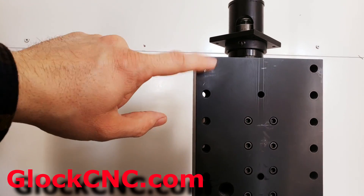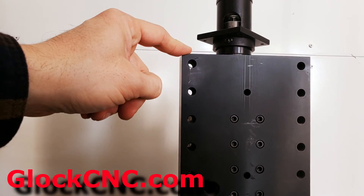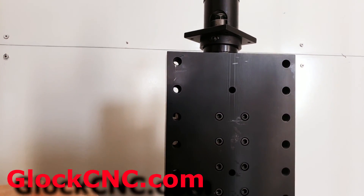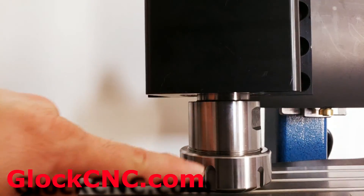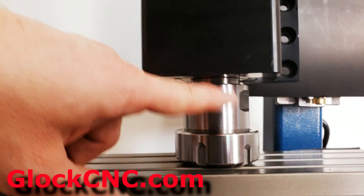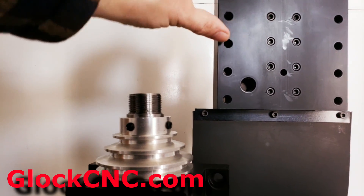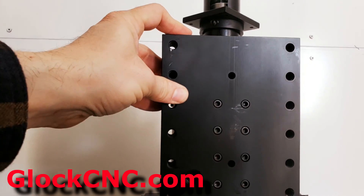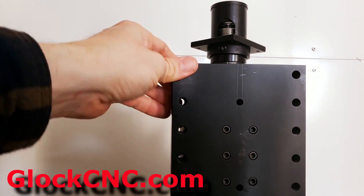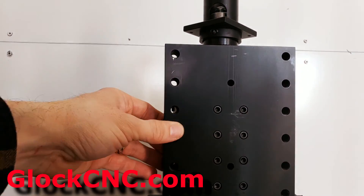The reason we did two different positions is that for people who like to use our R8, it sticks a little further below. The ER40 does too, and that will keep you with quite a bit of z-axis by raising it up here. You're not going to lose much rigidity — this is a one inch solid chunk of aluminum, so it's pretty solid and this thing bolts in there very solidly.